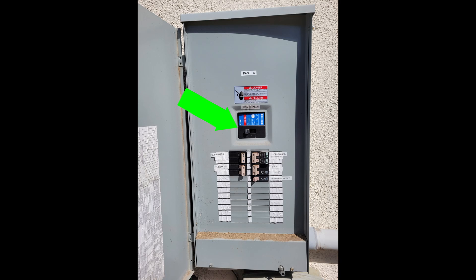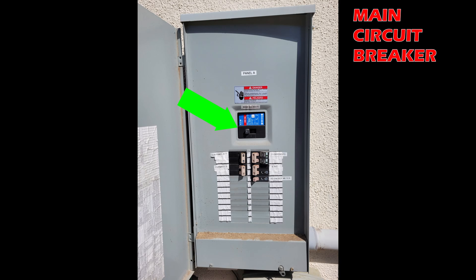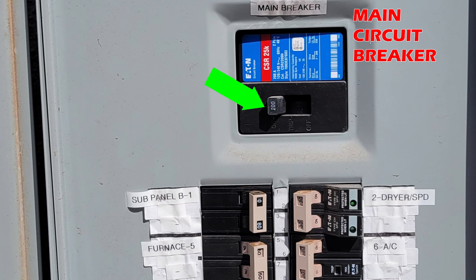This device is called the main circuit breaker, and it serves two purposes. It acts as a main shutoff switch — if I were to switch this breaker, it will stop the flow to the entire house instantly, which is extremely helpful in an emergency. Secondly, it's a safety device designed to trip off automatically when it detects a certain amount of current. Look at the rating and write it down — mine is rated for 200 amps. If you don't have a main circuit breaker, your home is probably older, and unfortunately the calculations I'm about to show you do not apply to you.